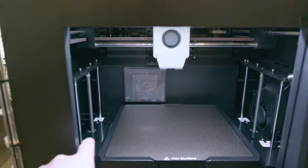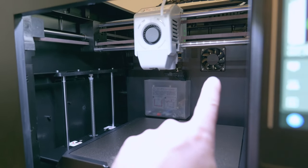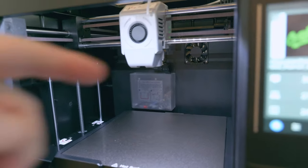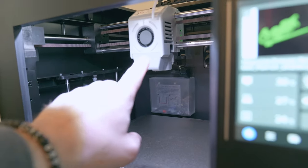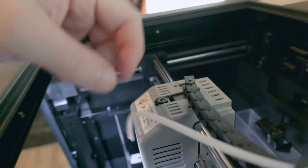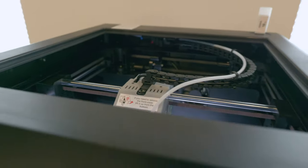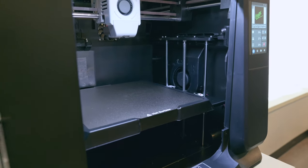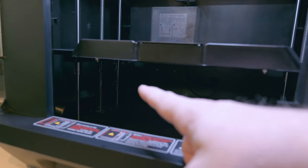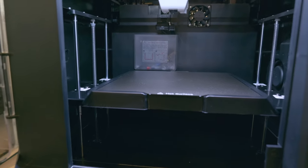The machine has a mechanical piece where when the tool head hits this part, it comes out and cleans the nozzle repeatedly. So it has a poop chute, a nozzle cleaner, and a bunch of filament sensors. It has individual non-belted dual Z, which is very nice — that means it does Z tilt. It has a chamber fan for blowing air out if you want to print with the door closed. The tool head has a lot more fins and openings in the cooling department, and that's definitely done well. The heating element is back there, which I'll cover in the pros and cons section.